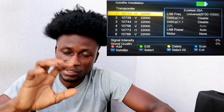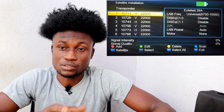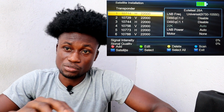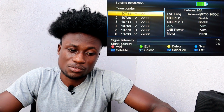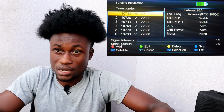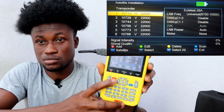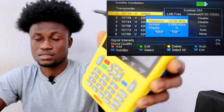Okay, so with the TP list over here, if you are to track for MULTITV Africa FTA channels, you have to add. So let's say MULTITV Africa that you need to track, which is 10804. Okay, so you have to add. So we have an indication on your screen, as you can see, red to add. So you have to press on the red button on your finder. As you can see here, you have red button, red, yellow. Okay, so you press on it to add.